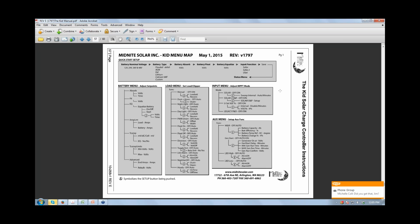Good. That's why we're going that route. Excellent. Much easier, and much easier to reset if anything happens, as opposed to replacing fuses. When I talk to people, I try to encourage them not to use fuses and to use breakers for that reason. It creates a really easy on-off switch, and we also need to be able to turn things on and off when we're troubleshooting.